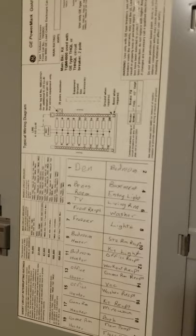Sometimes you have to look around a little bit for all the important information, but it says — let's see if we can get the camera to focus on it — right there, above the shadow, it says 'use only GE type breakers' and then it specifies what kinds are to be used. Since we're generalist inspectors and not licensed electricians, we have to go off of what the manufacturer recommends.